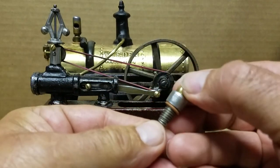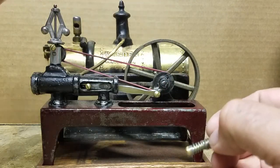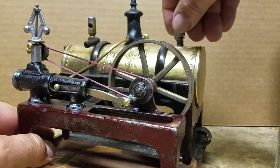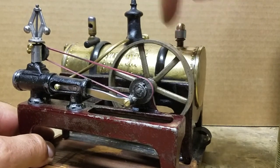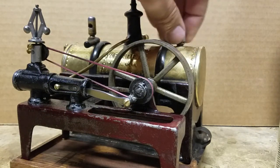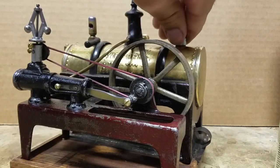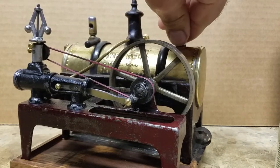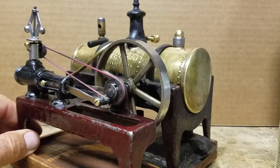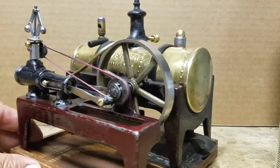It might be a bit stiff for my needs, but anyway. I also had to tap a 5/16th hole. I believe originally both the whistle and the safety valve were quarter-inch threaded, but this one was definitely bigger. Someone had put a round-headed screw in it that fit loosely, so I went ahead and tapped it and filled it up.